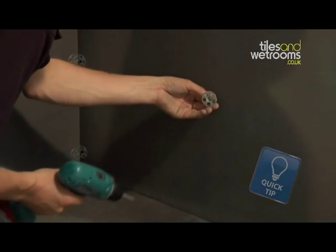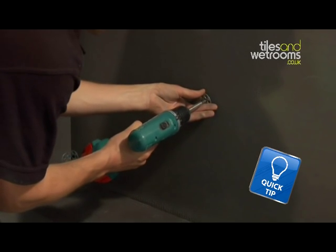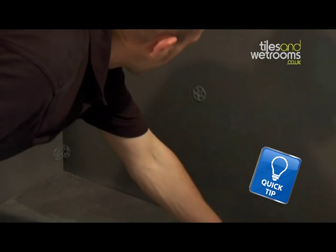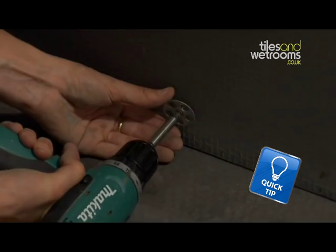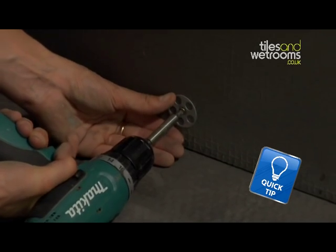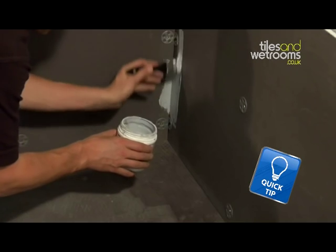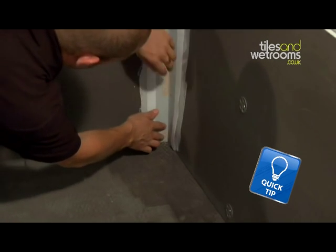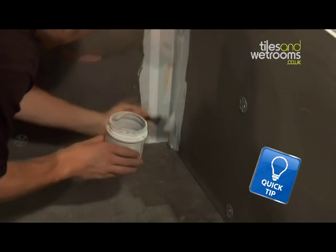Although in this wet floor installation you see the walls are lined in plasterboard, which is common in the UK building industry, we would highly recommend the use of our 12mm waterproof wall panelling due to its many advantages over plasterboard. It not only gives a waterproof substrate for tiling onto, but it also gives an increased insulation value in the room, a far stronger adhesive grip to tiles, and has anti-mould properties.